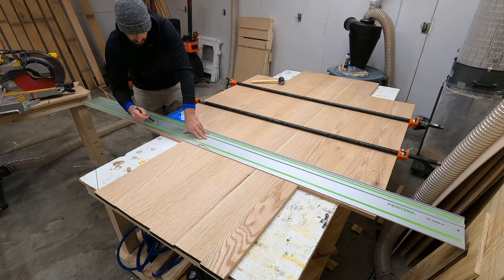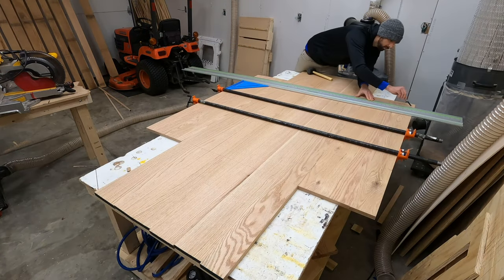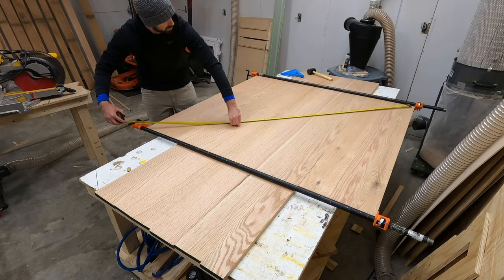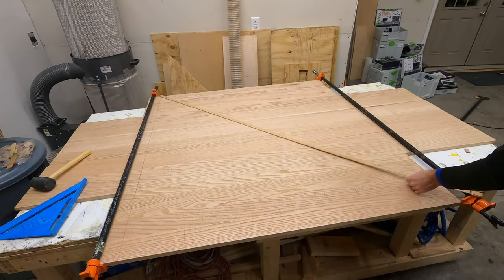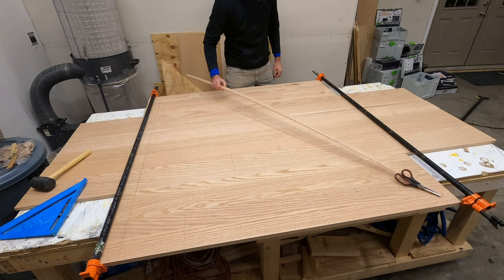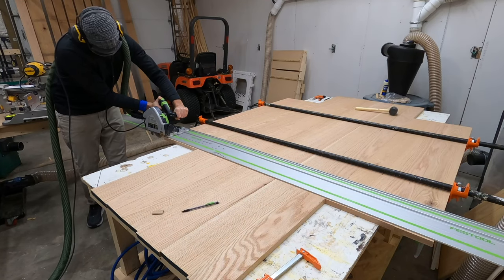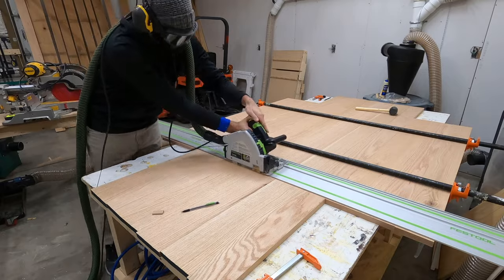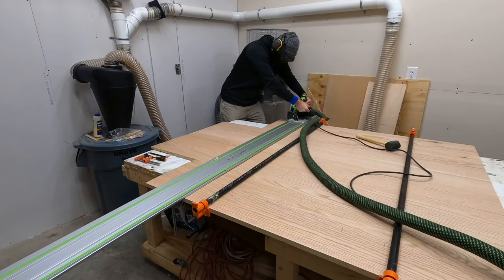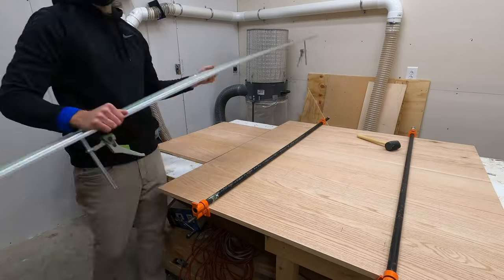With those extra side pieces in place I put some pipe clamps to temporarily hold it and then used my track from the track saw to mark what I thought was square to one side of the table. I don't trust my square for something this precise, so one way to fix this is to measure the distance from opposing angles and make sure they're the same length. I couldn't sneak the tape measure down in there so I cut a piece of scrap to the exact length on one side and used that to measure the opposite side. I was off by about a millimeter and a half over 80-some inches, so I just split the difference. I believe this is a trick used for framing the foundation of houses to make sure everything is square — if you know the proper term for this, drop a comment below.